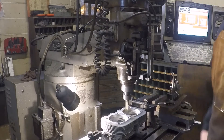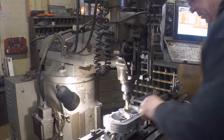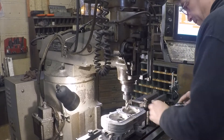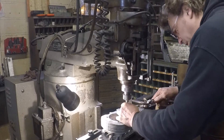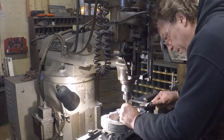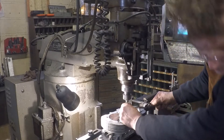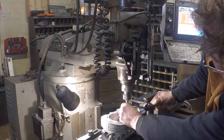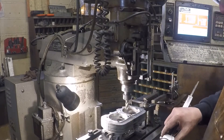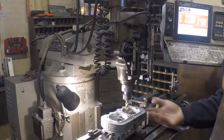I do know that 94 millimeters does kind of cut into those clearance holes for the studs, so I'm going to double-check here and make sure we're cutting where we need to be. Our target number was 3.986 and we are at 3.982 — which is fine. Smaller is always better.